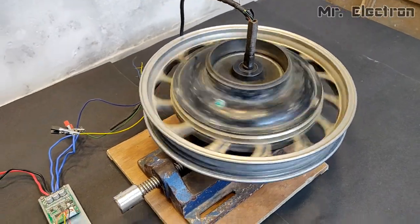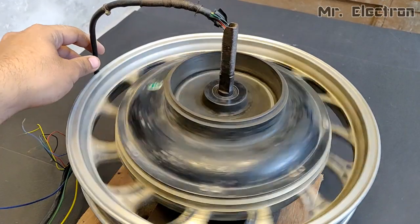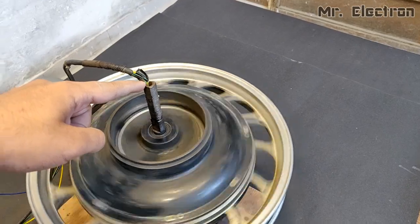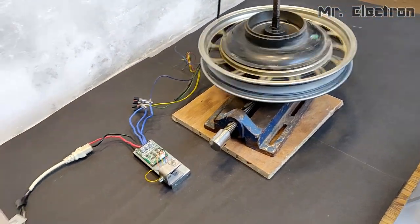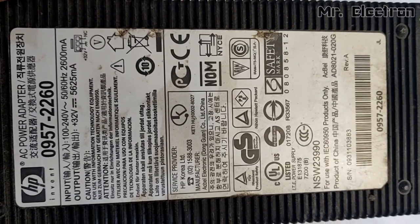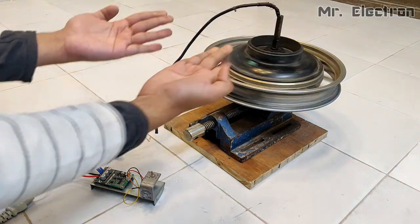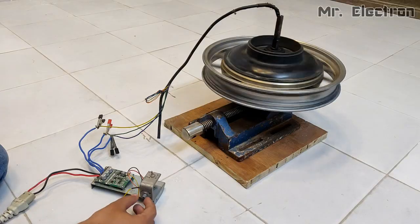It is working pretty good — it's making a sound because of this wire. I think there was a short circuit; the wires are a little damaged and I will have to repair them. But until then I can increase the speed — let's test how fast we can achieve. These are the disconnected hall sensor cables and this is the printer adapter: 32 volts, 5.6 amperes, light is glowing means it's on. It is running really good and I'm trying to stop it — it is just impossible. Very high torque because of its low RPM and large number of field poles.